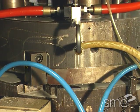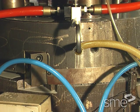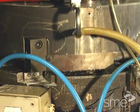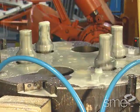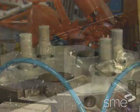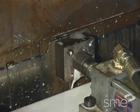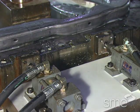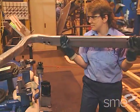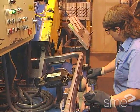There are several advantages to hydroformed components over conventionally manufactured parts. Conventionally produced multi-component parts can be hydroformed from a single blank, reducing part count and possibly weight. Most, if not all, forming and piercing operations can be performed within a single hydroforming setup, and scrap rates for hydroforming can be significantly lower than traditional stamping scrap rates.